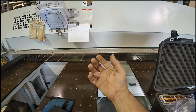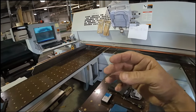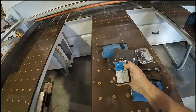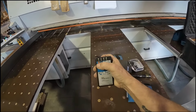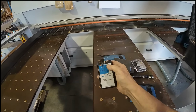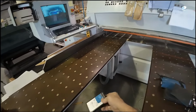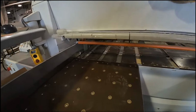If you have one of the sensors that you can teach its processes, whether it's normally open, normally closed, or sensitivity, or all the little things, there are some sensors that are extremely intelligent. That's when you would get in here with the teach function, and you can teach it to do whatever you want. From my diagnostic standpoint, I energize it with the plus, the ground, and then I use the black wire for the neutral. If the white one is there, I go ahead and connect the white. A lot of times it's not. That allows me to run that sensor from this box and be OSHA compliant. And that makes a lot of EHS people happy.